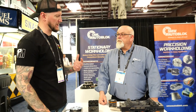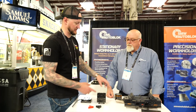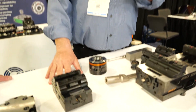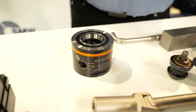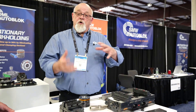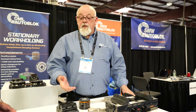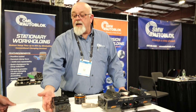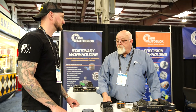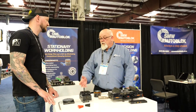When we're talking about things like risers, what's the purpose of those in an application? The risers are used on a five-axis machine when it tilts the table 90 degrees — that's the worst condition, or past 90. The headstock comes down, and the work holding is too close to the table. The spindle head hits the table, so now we have to rise it up. Not all jobs have that option. If the part's super tall and you're not tilting at 90 degrees, you can get around the part. But if you have to go around a part at 90 on an angle, you need to rise the part up. The zero-point allows you to add risers at any time by just adding a riser to it, and lower it very fast with a quick-change device, whether it be zero-point or Plus-Five.